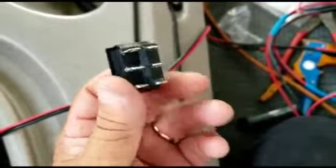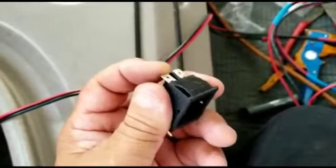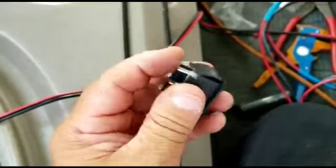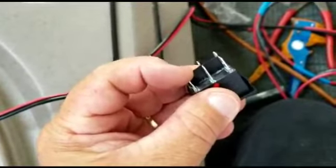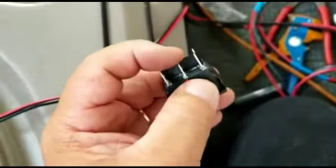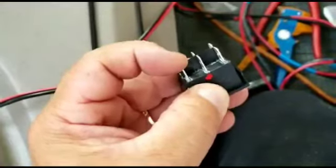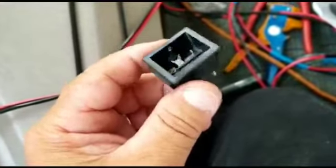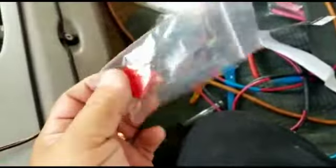I just realized that one of these pins is broken. When you wiggle it you can see the play in it, or you can feel the play, and that's an intermittent contact right here — this one just wiggles. These other ones are nice and solid, but this one wiggles like crazy. So after I cleaned everything I realized that pin was no good, it's busted.